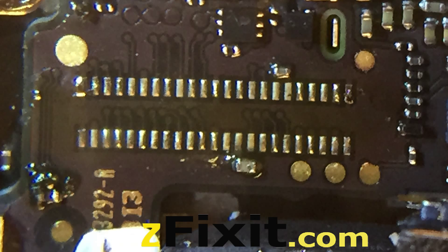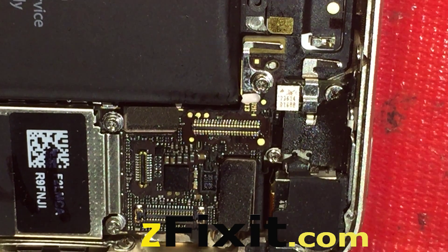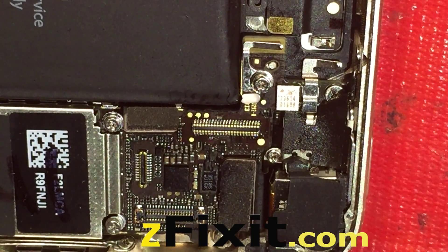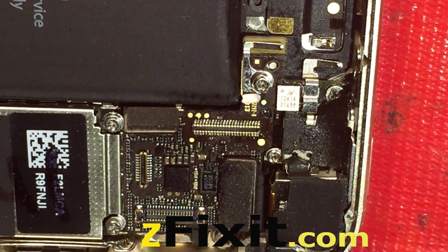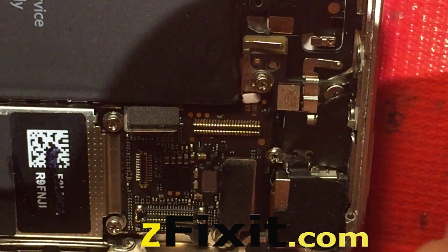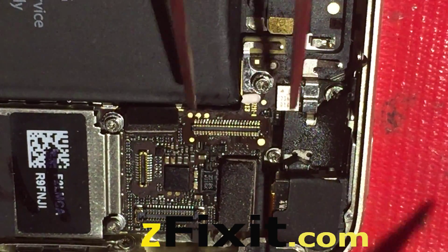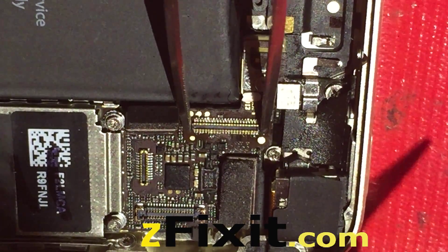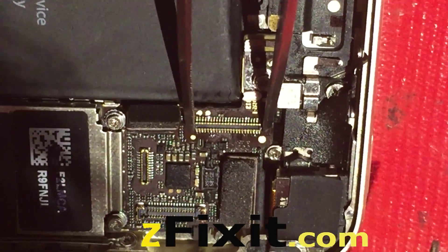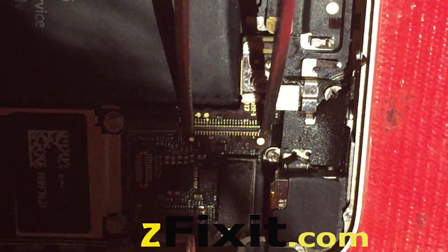This is not an issue with an iPhone 5C FPC digitizer replacement. The key to this particular repair is getting the new FPC properly aligned onto the solder pads — that is probably the most time spent. It has to be perfectly positioned: left and right, top and bottom. It has to be over all solder pads.